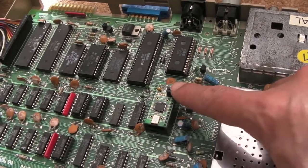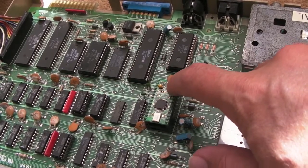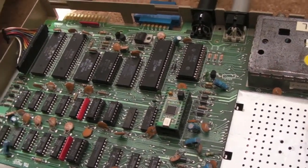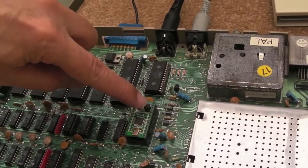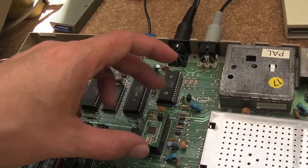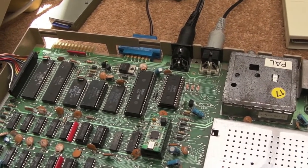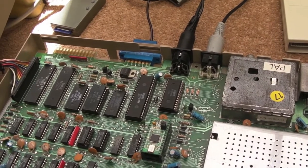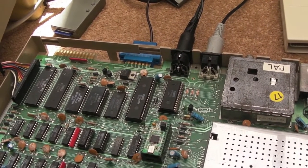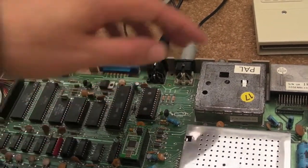You'll see there's a couple of jumpers on there. One of them, the board is actually marked. I think it says set board filter. So you can put a switch to one of these jumpers, or maybe both, and toggle between how it sounds, between the two different types of SID, the 6581 or the 8580. That's quite a cool feature, because it allows you to have both in the same system with a single chip. But anyway, it's in there now, so I've switched it on.